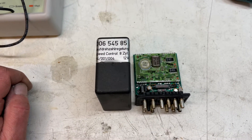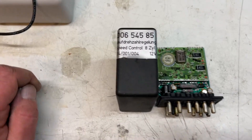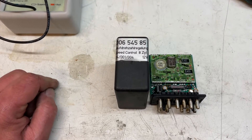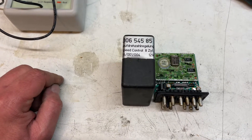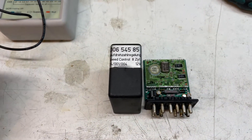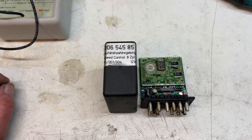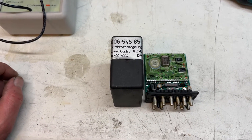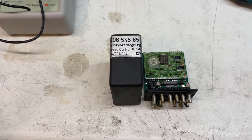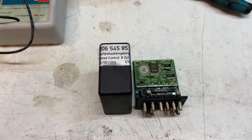The other thing I found more or less by accident yesterday: I have a dead spot on my airflow potentiometer. The little thing which sits on the side — when you depress it to a certain position, it suddenly jumps from two kilo-ohms to eight kilo-ohms. It goes smooth the way the manual describes, but then there's one spot where the meter just spikes. So that thing looks bad as well. It hooks up to the ECU and shouldn't have a big impact on idle speed, but we'll see. I'll keep you guys posted.